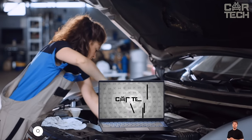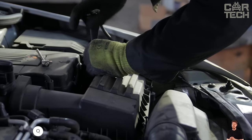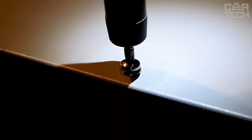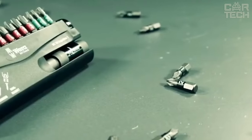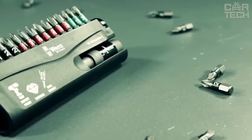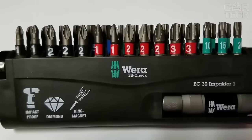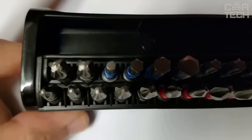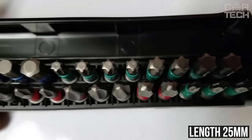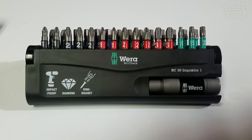What repairs are possible without bits? You can't unscrew or screw anything without bits. The set consists of 32 different bits, suitable for both screwdrivers and electric screwdrivers. All bits are made of alloy steel, have magnetic properties, and a special anti-wear coating which will help make the bits more durable. The set includes different torxes, hexes, flat, and shaped bits. The length of the bits is 25 millimeters and the diameter of the seating face is 6.3 millimeters. They are fixed and stored in a special plastic stand.